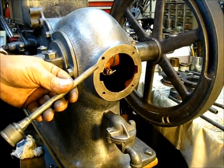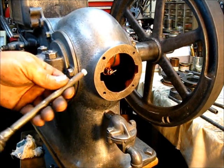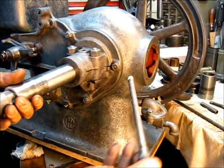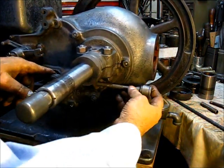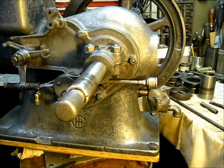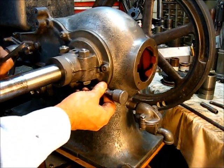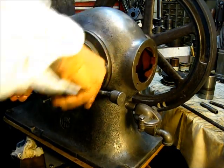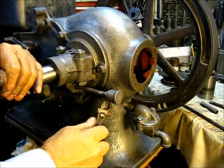This part right here, we ain't got that on there yet. And this right here — a little gas holder right there. That brown Permatex works really good too. You want that to be a good leak-free fitting. This is the greaser, and I already tightened that up over there in the vise. This is the greaser that greases the camshaft — the part between the gear and the thread is right in the back of it. Most of the time you'll find these greasers are some kind of size between this and that, so a good crescent wrench works here. Tighten that up really good — you don't want any leaks.